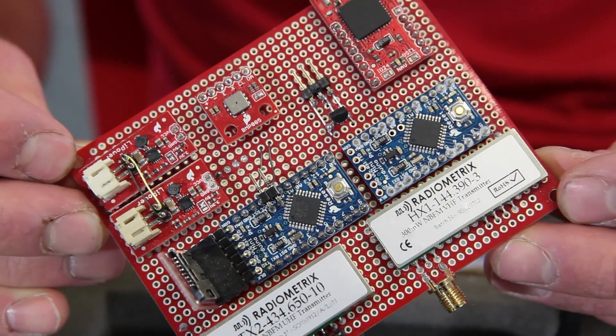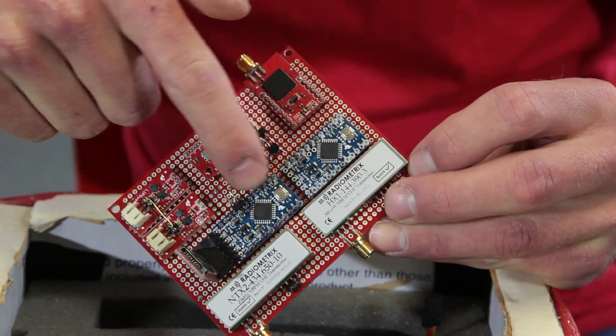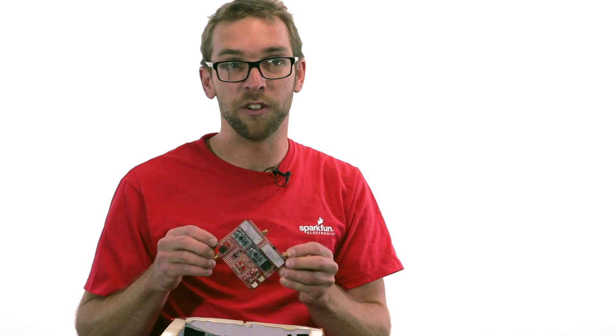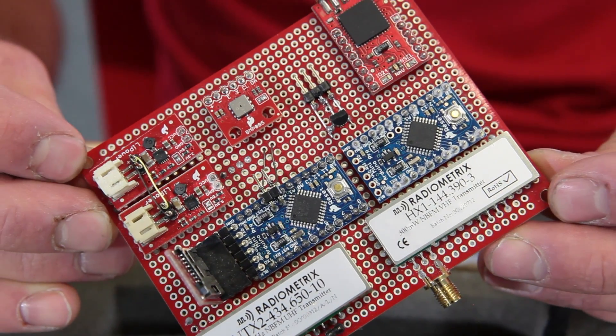I have a little flight computer here. This particular one has a GPS unit for tracking. It's got two redundant radio modules and two flight computers just in case anything fails. I'm using a ham radio downlink on both of them. One is APRS, which is an automated position reporting system that is really well known in the ham radio world. It's used for tracking different things, whether it's a guy on a bicycle, a guy in a car, a weather balloon, or what have you. The other one is a 70-centimeter downlink that I can use for more real-time tracking.